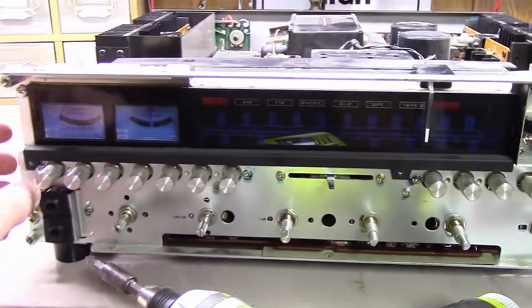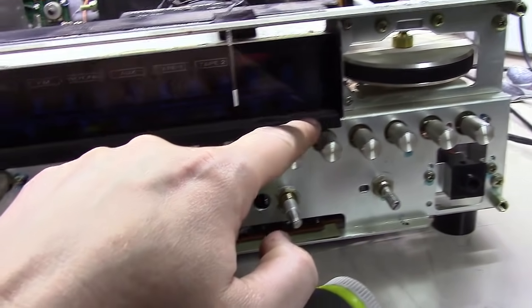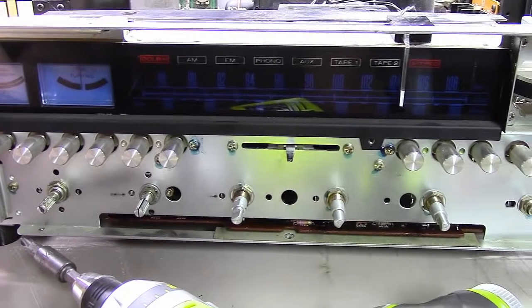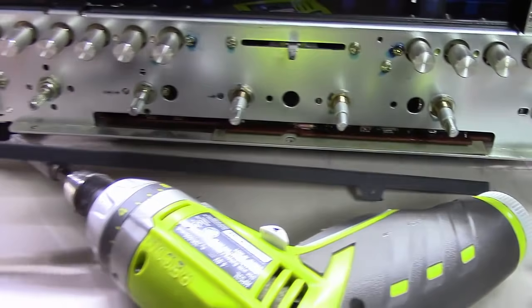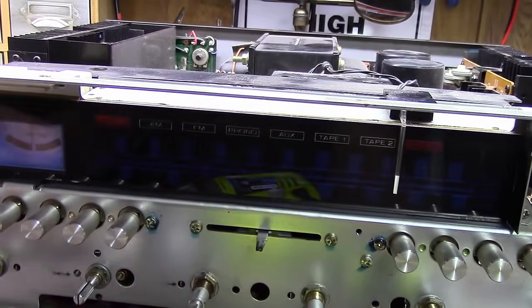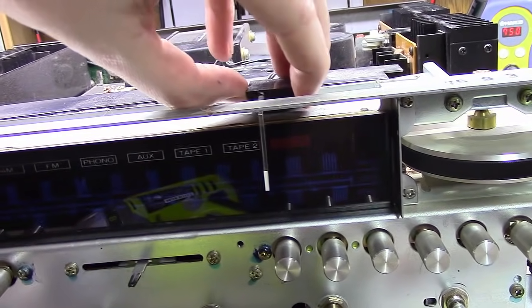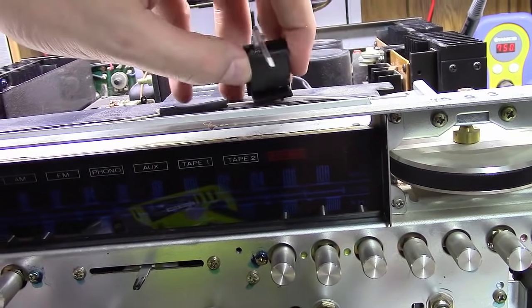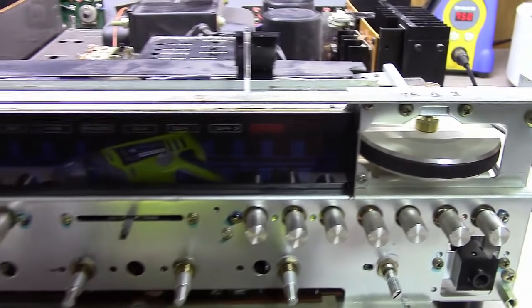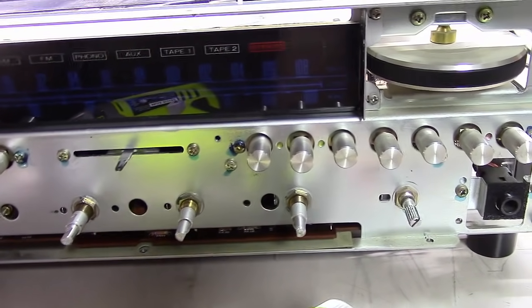To get into the face of this thing, there are two screws — one here and one here — that hold this little black bar across the front in place. Once you get those, you can pull that bar right off. Then there's really nothing holding the black face plate in place other than some glue around it. We'll have to lift the dial indicator out of the way as well, and we'll end up cleaning up all the old grease on the dial mechanism and putting some new grease on it. The next task is to get this black face plate pried loose.